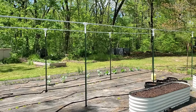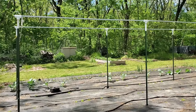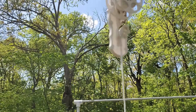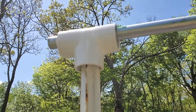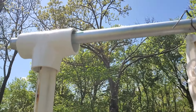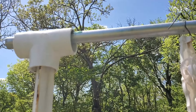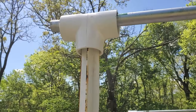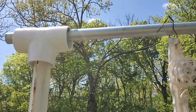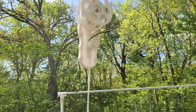Okay, so I got those two rows knocked out — pretty simple to do. I think it's going to work pretty good. If anybody can drive a T-post, you can set this up; pretty easy to do. Also, another thing you can do where these connections are made is just run a self-tapping screw through that PVC pipe into that conduit. I may actually do that myself — I'll probably pre-drill them to make sure it doesn't crack. I think it'd be better to just go ahead and put a screw in there to hold all those connections together. Anyway, thanks for watching.